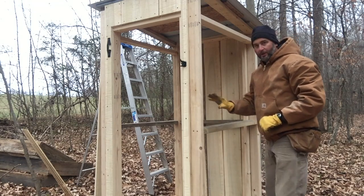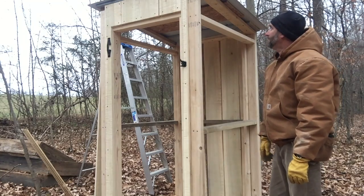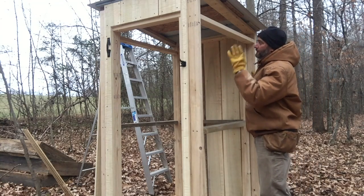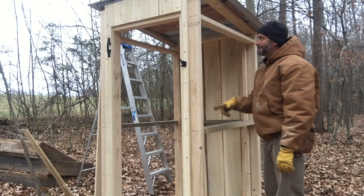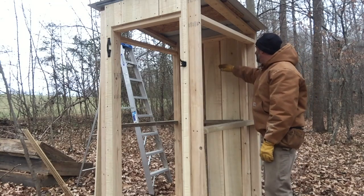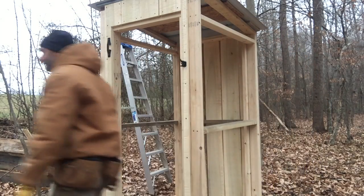So what I'm going to do is start on the right wall and get that put in. It has a little bit of a lean back, it's about 1/4 inch off. If it was a house I was living in, I'd probably change it, but I think as I put the boards on, I'll just give it a little tug forward and that should stiffen it up. I'll probably at some point do a cross member, but the problem with that is I want to have racks. Actually, that's not a problem because I can mount them from here and then hang them from a chain, so never mind. I'll put a cross beam on there and that'll help stiffen it up. So I'm going to go ahead and start putting boards on.